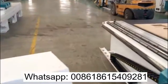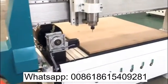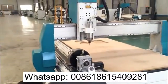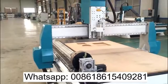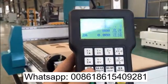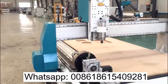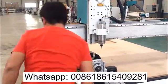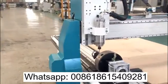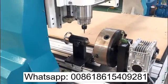And now I'm going to switch the limit switch to the rotary. Now we move the machine far away from the limits. X as well. And we're going to home the axes. Now the machine is homed to the rotary axis home position, so right now you can work on the rotary axis.